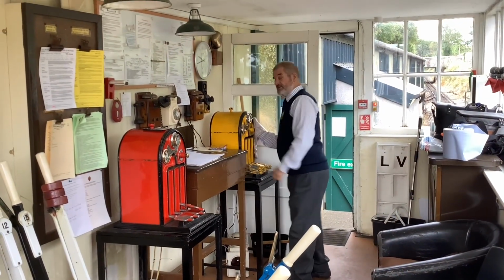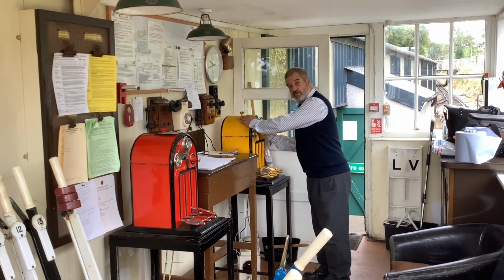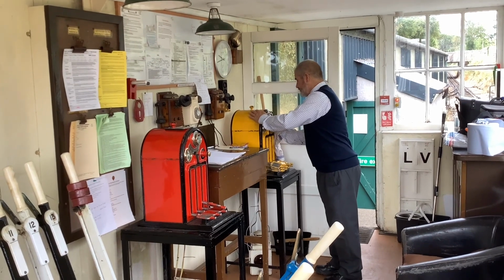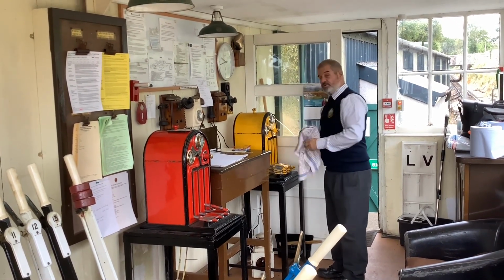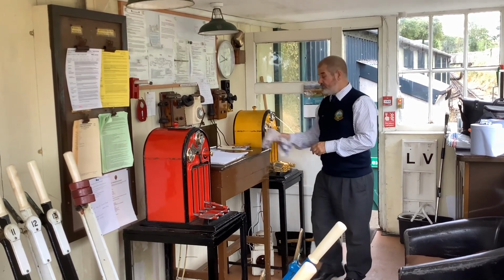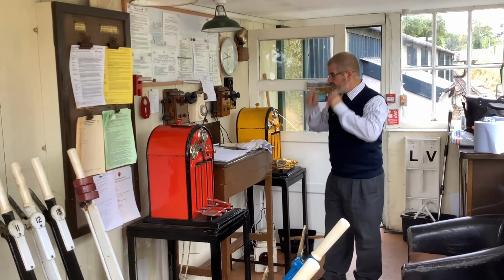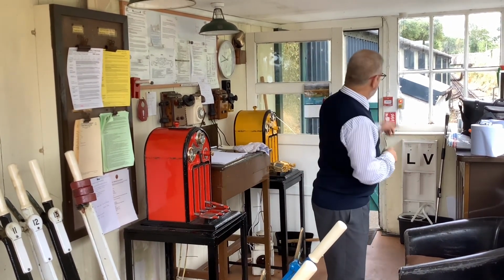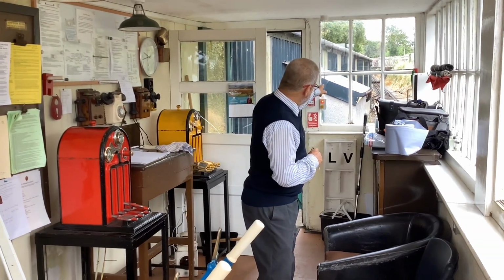East, the service train being offered now from Wharf. So we get 3-1, which we acknowledge because the line's clear to the clearing point. And he should give us a little bing, a single bing like that confirms he's got it out of the instrument, which they don't do elsewhere, I don't think. So we know the line's clear to the clearing point because the clearing point is the down limiter shunt board, which is on the bridge face down there. You can barely see it.